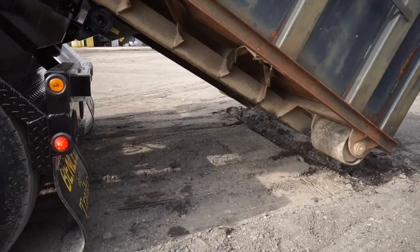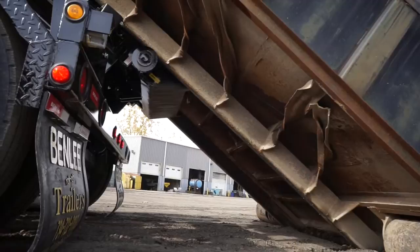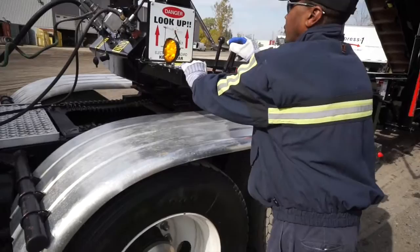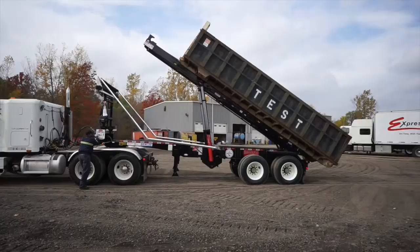Pull the left lever to roll the container off the upper frame until the box touches the ground. Pull the right lever to extend the stinger tail. Continue rolling the box off of the upper frame. It may be necessary to release the trailer brakes while unloading the container to allow the trailer to roll forward and out from under the container. Warning: use extreme caution when rolling the truck trailer forward.